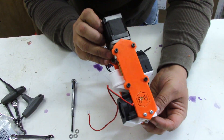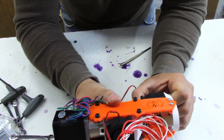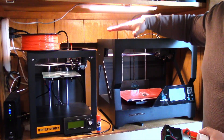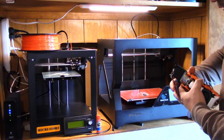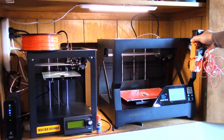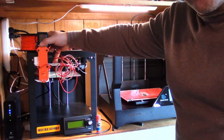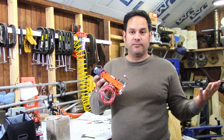There we have the entire extruder assembly — it's actually a very interesting little unit, compact. Unfortunately, I can't test this out just yet. Here are my two printers: this is the D200 and this is the Mi Creator 2. This one is much smaller than this one. The problem is this is a 300 by 180 by 180 millimeter printer and the extruder needs to sit all the way against the frame, which will be a problem — it's not going to fit. On the Mi Creator 2, I can get away with it in one position, but when the extruder moves all the way to the left-hand side it would also hit the frame. My printer is just too small.